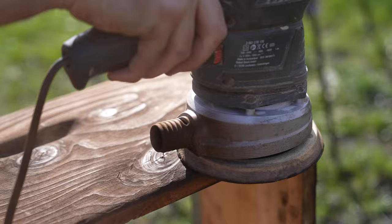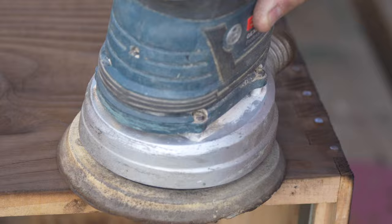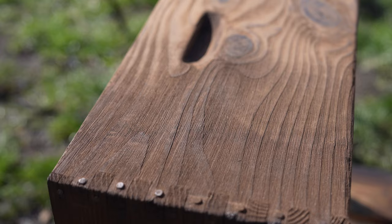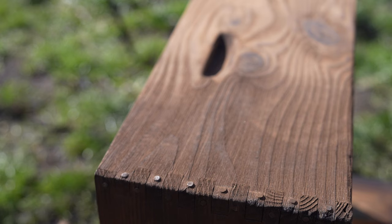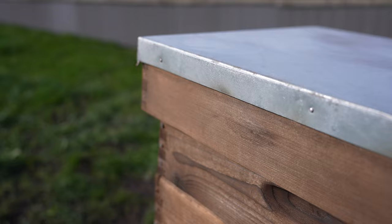You want to be working again with the grain — 240 grit. You don't need anything coarser than that, you don't need anything finer than that. You can see the difference there: that half is the half I've sanded with 240 grit, and over here you can still see some of that carbon just in between the grains. You can keep a little bit of that in if you like; I prefer to sand it right back so the oil can penetrate really well in the next step. Really starting to come together now — perfectly smooth finish, brushed out all of that carbon, and raised the grain a little bit.